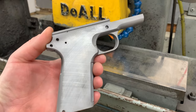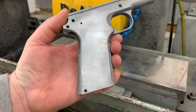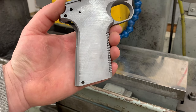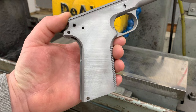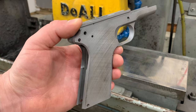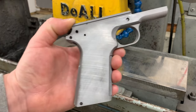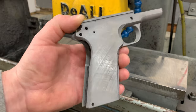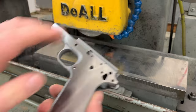You can see there's a little bit of overspray on the flats and that kind of Blanchard crosshatch grinding pattern. It's actually pretty neat looking, but especially for a firearm it's not really a decent finish. So that's why we do finish grind the parts.